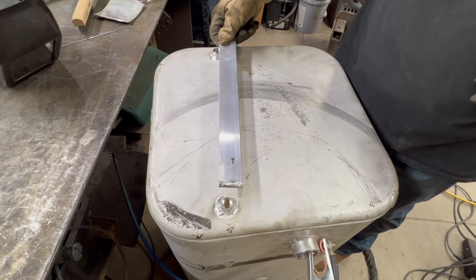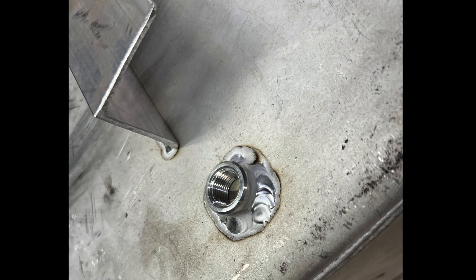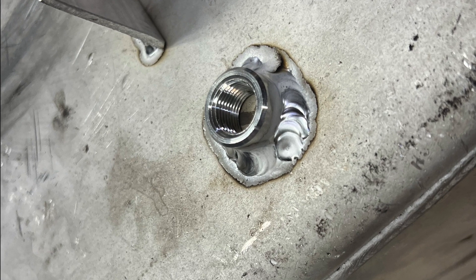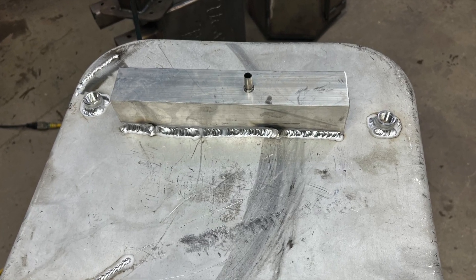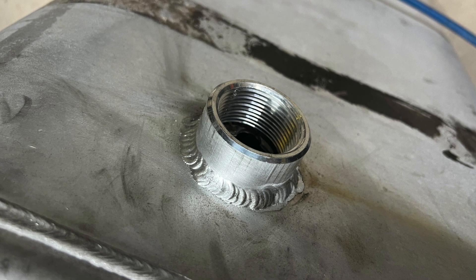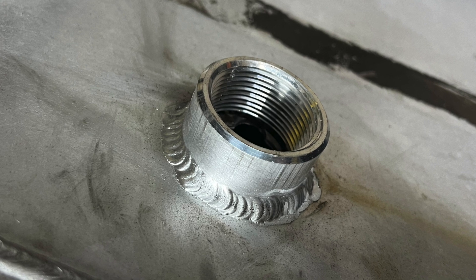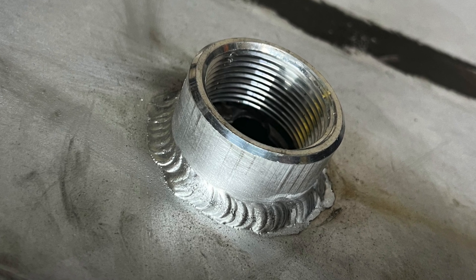The angle is on there to protect the side glass and it was all welded on already. You can see where the angle is and one of the fittings welded on there. I didn't get any video of the tank finished because the customer picked it up and I never thought to film it. Here you see the outside patch and the side glass with that angle protector. There's also another fitting where we removed that sending unit from the first shot - instead of patching over it, there was a nice round hole so I put a half coupling on it so the customer can use that hole if needed, or just plug it up. It was cleaner than putting a patch over it.